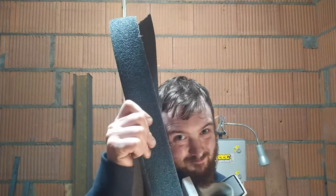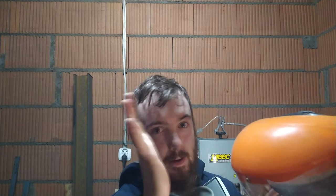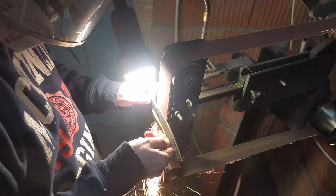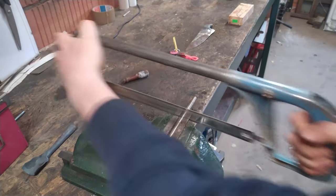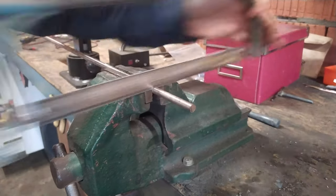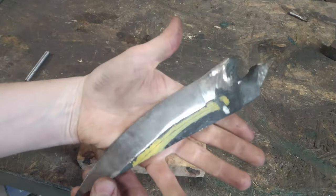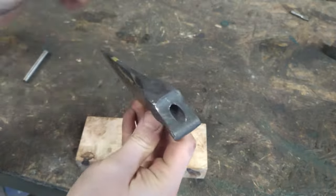This is why I always wear a hood — and this is not a joke. This is 36 grit. I just got hit super hard on the mask — it was like someone hit you in the face. In fact, this wasn't the first time I've been hit by a belt that just broke. Guys, please be careful — it is not a joke. The belt grinder is dangerous, and if you work alone like I do, PPE is necessary.